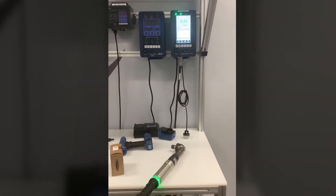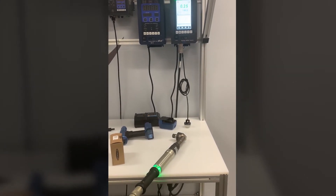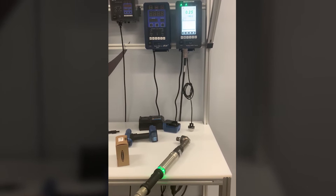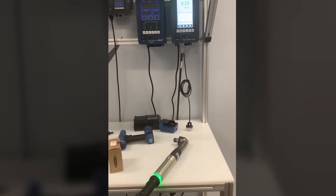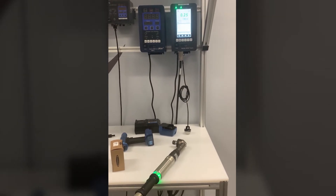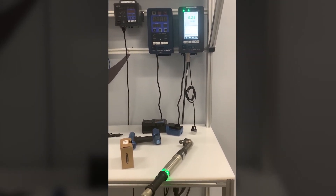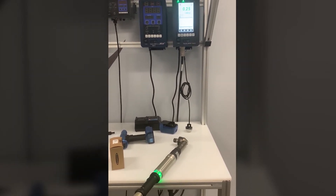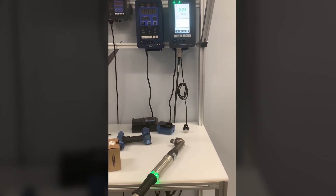The way this helps the operators is that when they acknowledge, they can come over and make sure they're on the right bolt sequence and the right bolt before they proceed to torque a smaller bolt at a higher torque value. So with the Essex system, we bought a banner touch light, and that provided the acknowledgement step inside of some direct I/O and PLC ladder.